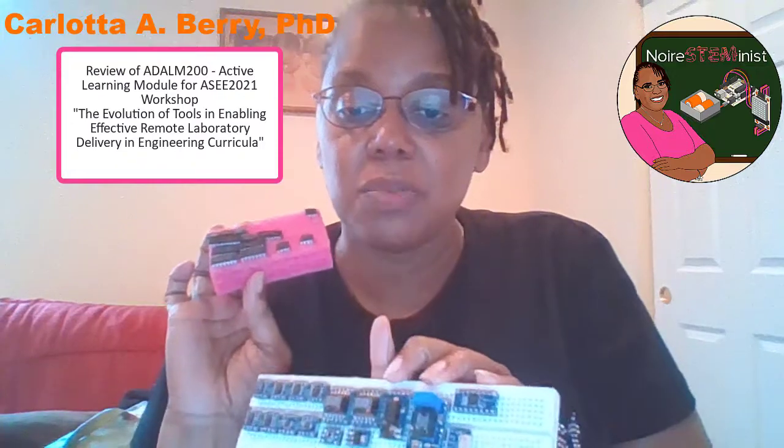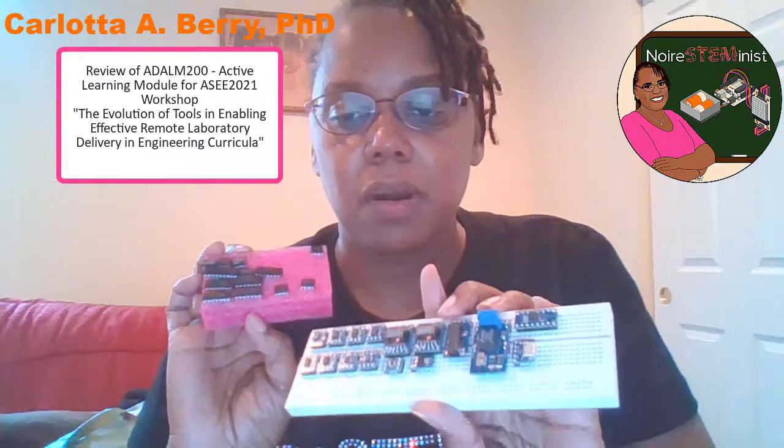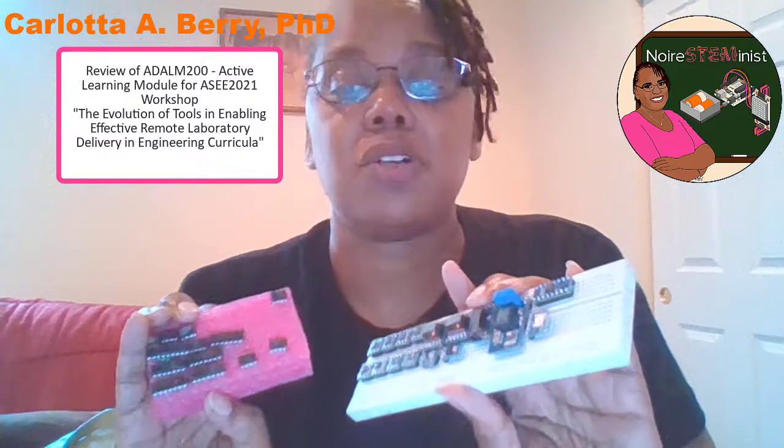The first thing I've done is installed my software, connected it, and I have my scope running. Now I need to build my circuit. This isn't totally like being a student anymore because my old eyes cannot read these capacitors and find the 103. I'll keep hunting. One thing I'll share is that it would have been helpful if the breadboard didn't come like this — when it arrived there was nothing on the foam and there are all these chips on the breadboard. The challenge is I can't build anything because the protoboard is already populated. I have to take time to figure out where to put these parts while being concerned about ESD. I've got my magnifying glass and flashlight from my cell phone, so as soon as I can get the protoboard cleaned up I'm ready to start building.